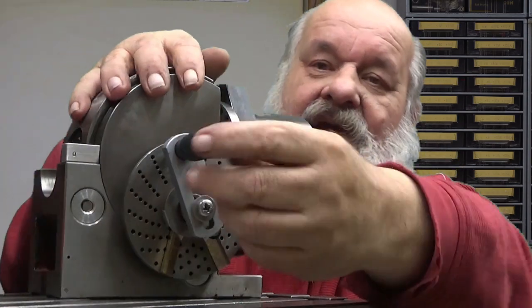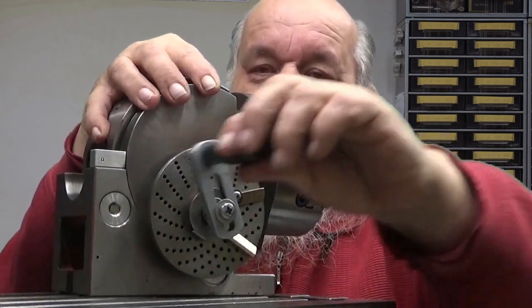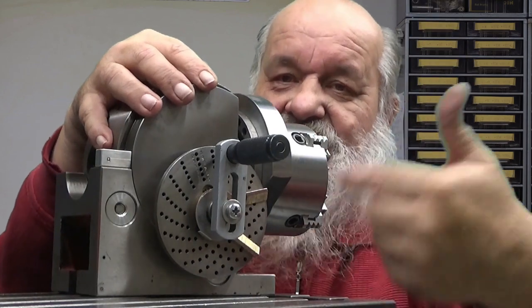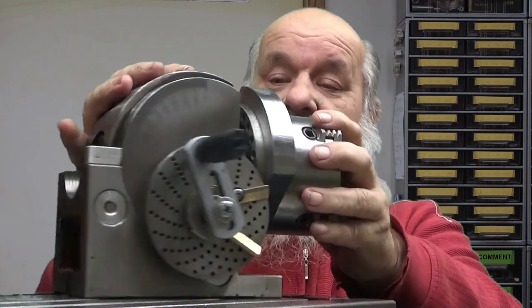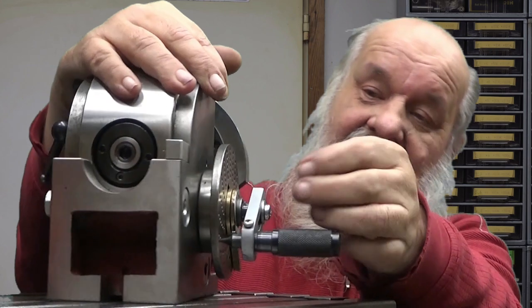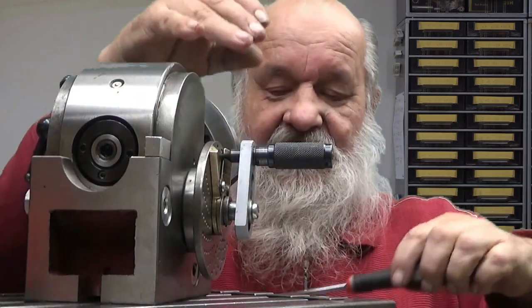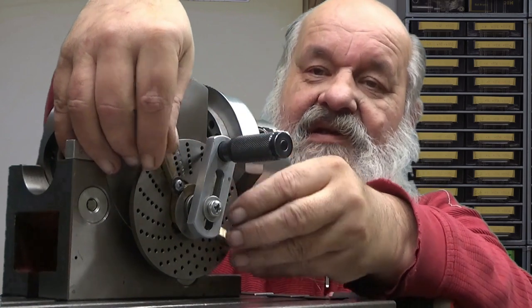Okay. Now, when you turn here, you can see the chuck is rotating. So you have to rotate it 40 times really, and then this will rotate one turn. Well, our division will be such that we will be using 8 holes from this disc. And now these sector arms come into play here. I will loosen that one so we can move these sector arms like this.